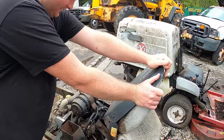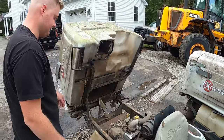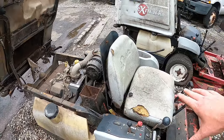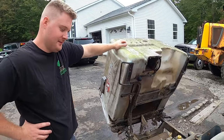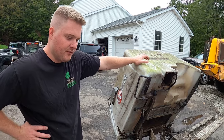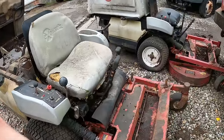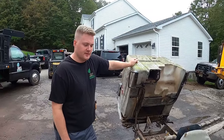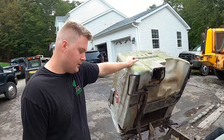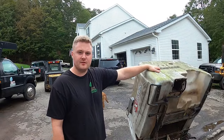These things have been sitting. The seats have both seen better days, the blower fan's in good shape, who knows about the hydros. Like we were saying with the X-Mark Explorer — the chute is not attached to the seat, so the seat flips up separate from the dumper. I like that better because it all gets stuck in the platform and rots. We already bought these six years ago and went right back to the Walker. Walker should look into switching to this design, and maybe making the pins on the Walker deck a little bit heavier and replaceable. But the Walker is our machine. On the X-Mark, it does look heavier duty — no frame problems like the Walkers — but you have to swing the fuel tank open to get to the belts.